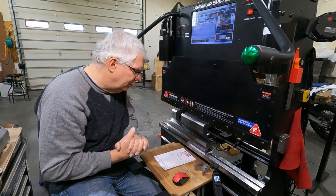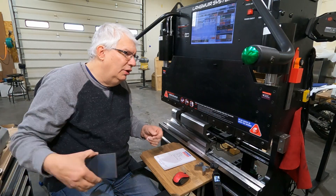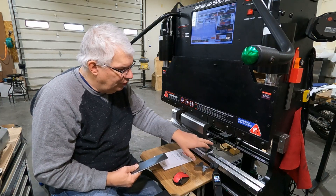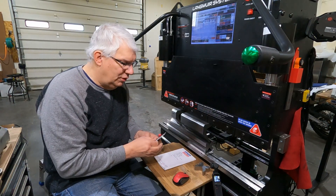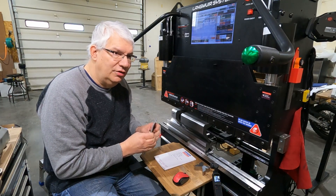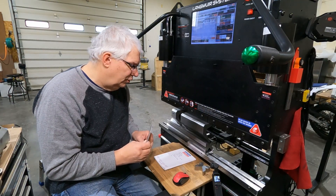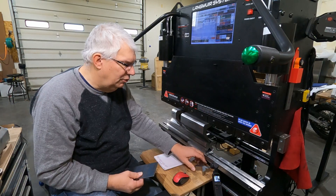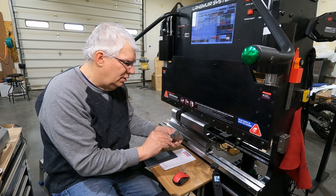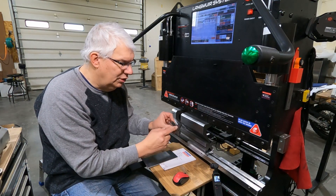Let's go over some of the things that came out of it. First of all, there's kind of an unwritten rule or guideline that the width of your die should be 8x the width of your material. This is 0.18 inches thick and 8x that is 1.44. So we're going to move to a die over here, and I've chosen the 1.378 die width on one of these four-way dies.